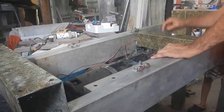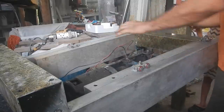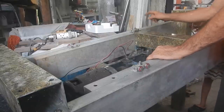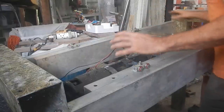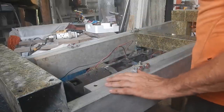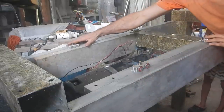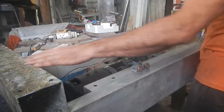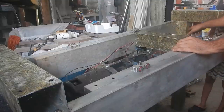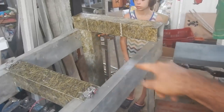Beauty. I guess I can take this off and then finish this thing and get it connected — take this big heavy part off, cause I don't need it attached here to work on this part, and this part weighs hardly anything. And then I can work on this, make the frame that it goes on. Although something's a little bit crooked — these two wheels are not touching, these ones are barely touching, and most of the weight's on these two. So this is a little bit twisted — either this is twisted or this big frame is twisted. It could have to do with the fact that I'm supporting it on the ends not very well. The twist is such a tiny amount. I adjusted these poles down here slightly and it fixed it.